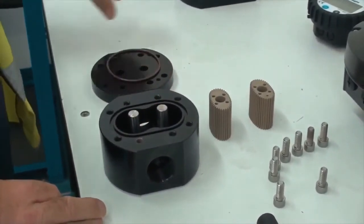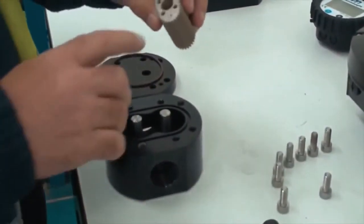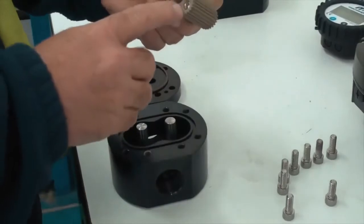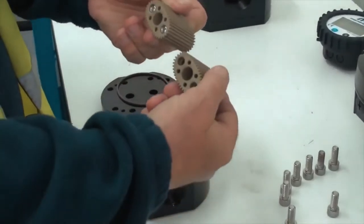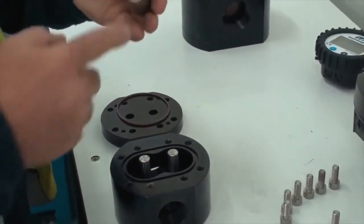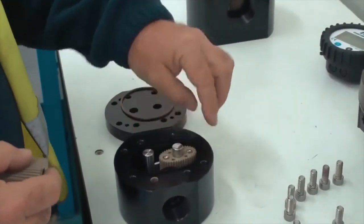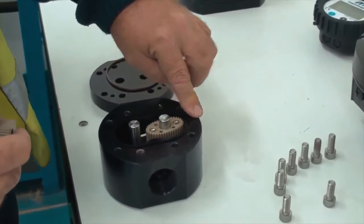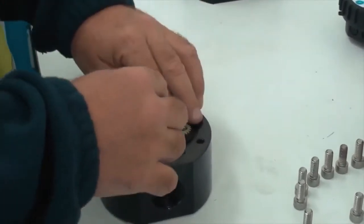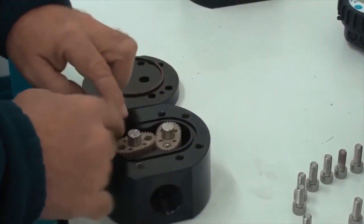There are two rotor types: the active and the neutral rotor. The active rotor has a dimple and contains magnets; the neutral rotor has neither. The active rotor goes in with the magnets or dimple facing down, positioned at the top — so dimple on the rotor aligns with the dimple on the housing and the dimple on the cap. The neutral rotor goes in the same way, and then both should turn nice and free.